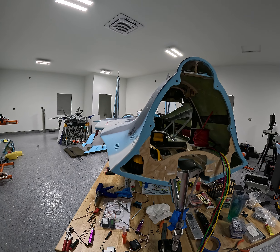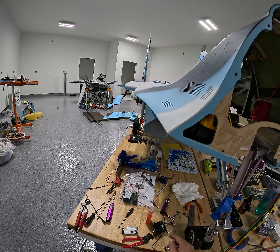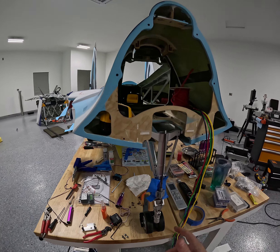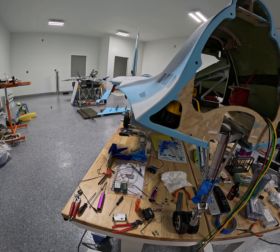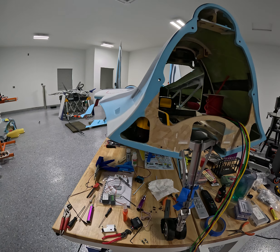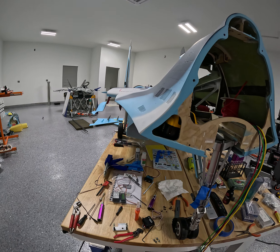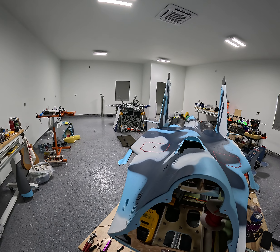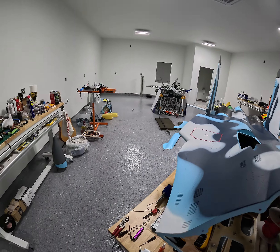So I kind of backstepped a little bit — I took this top plate off. I'm putting in some stainless steel screws and then I'll put it all back together and just go with it. I've got more torque than the factory spec — the factory and most people use MKS servos at something like 600 ounces of torque. This is 900-plus ounces of torque, so it should be fine. Everybody says just don't move the nose steering unless it's moving forward — I'm like, well, that's crap. That's why I hate direct drive.